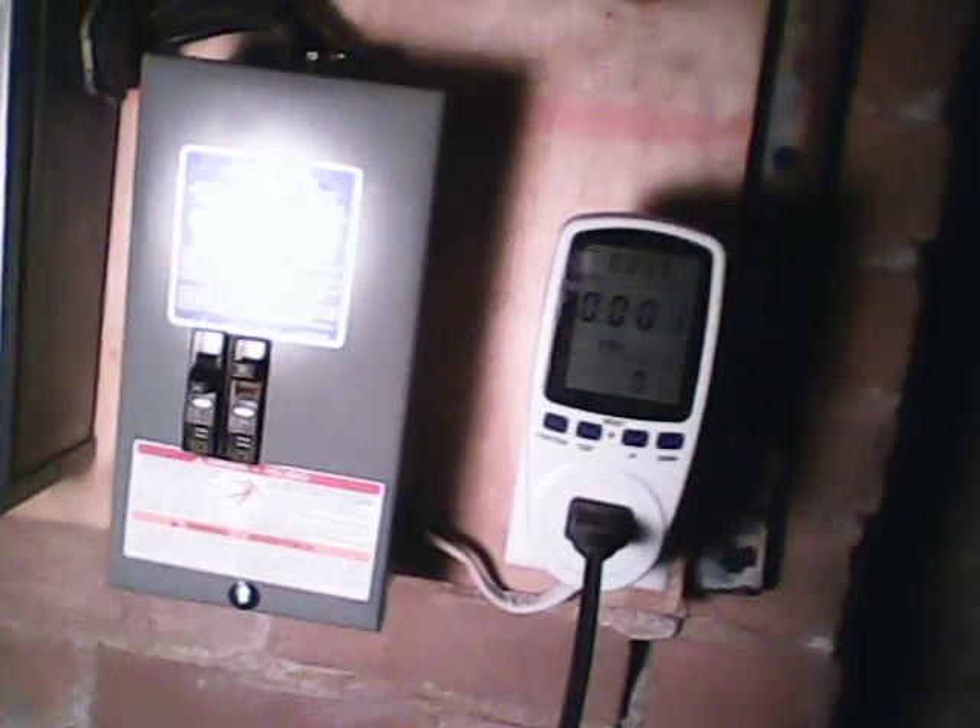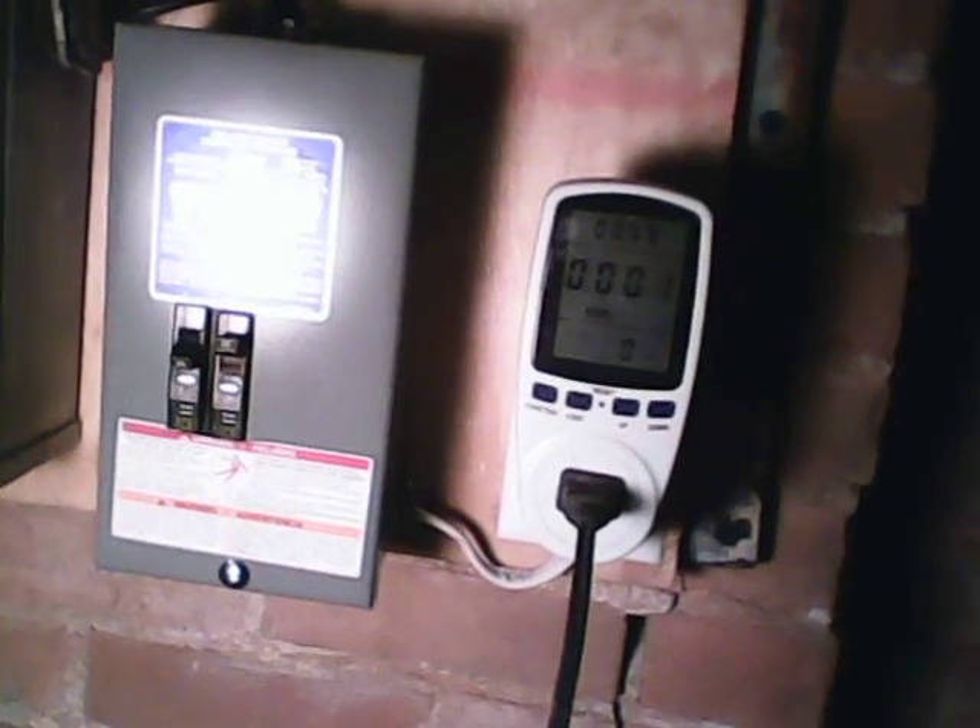This bulb is running at just close to one watt-hour per minute, as you'd expect from a 60-watt bulb — that's 60 watt-hours per hour, so one watt-hour per minute. I've checked this for longer periods of time and they do seem to agree quite well. It's very nice to be able to read this meter as that wheel rotates. So that's where we stand. Thank you.